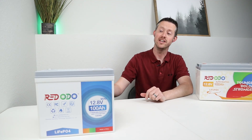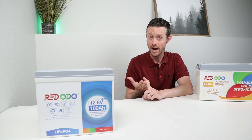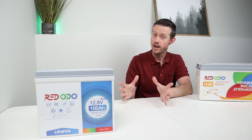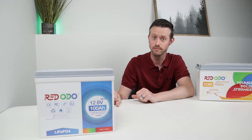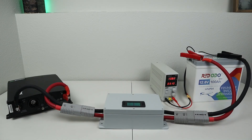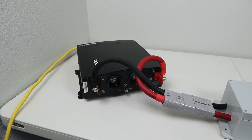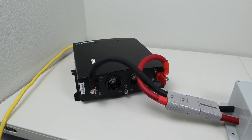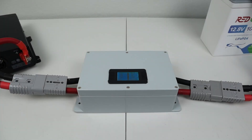In the rest of this video, let's do extensive testing to see if we can pull full capacity, get full rated power, and we'll also do a teardown to check build quality and low temperature charging protection. My first test was a full capacity test. I finished topping off the battery using my adjustable power supply, and once it hit 14.6 volts it was finished charging. I then connected up a 250 watt load via my inverter to discharge at a 0.2C rate, tracking the load via a contraption with a built-in display, shunt, and fuse.